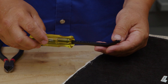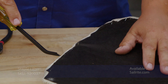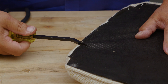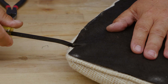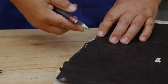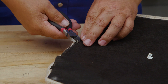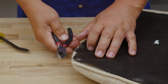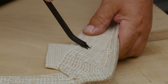This is the staple lifter tool available at Sailrite. This is my favorite tool for lifting staples mainly because it just has really sharp prongs and it's very strong. In some applications you can actually remove the staple completely if you just give it a twist with your finger. Sometimes they can't be removed all the way and then you'll use needle nose pliers or a wire cutter — it grips the staple nicely and pulls them out. Once that's off, we remove the staples holding the fabric and also the piping or cording.